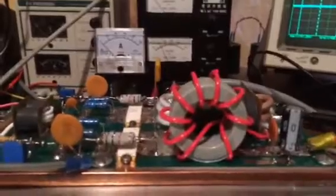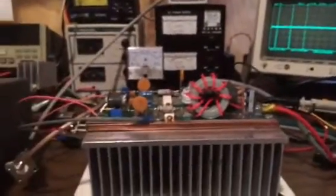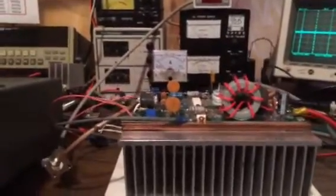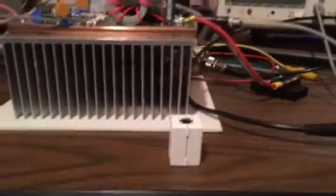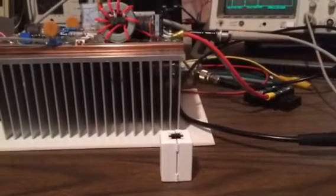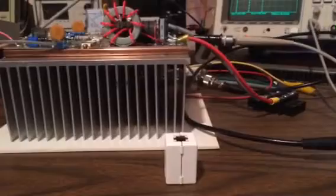You need a clean, well-filtered power supply with a very large RF choke — that really helps clean up the RF. Some power supplies can be noisy, so you may need to add a couple of snap-on ferrites on the positive and negative leads of your 50-volt power supply to clean up ripple and add a bit more impedance.